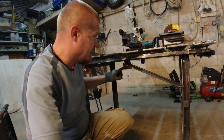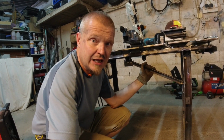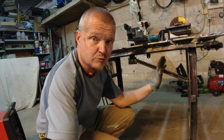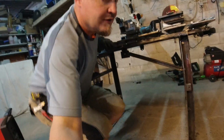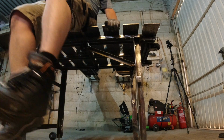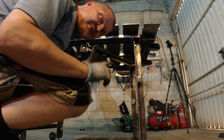The plan is to make another part of this brace to go to the other leg, as you know, but I've made one so far, and I thought it would be interesting for you to see what a difference one brace makes. Before this brace, this was a parallelogram. That's why it kept moving. Now there's a triangulation here, and it basically doesn't want to move. There you go. Thanks to this one triangulation, it is that much stronger. It's unbelievable what one single triangulation does.